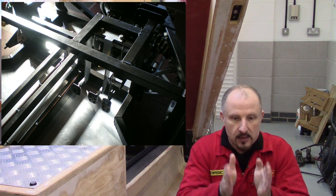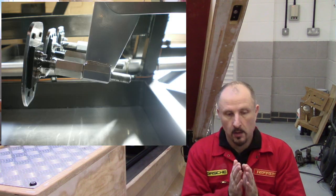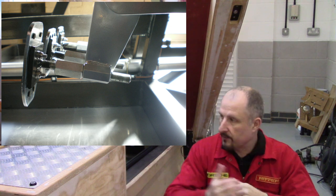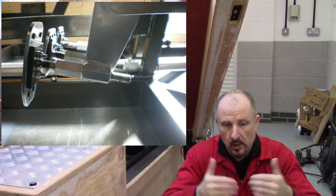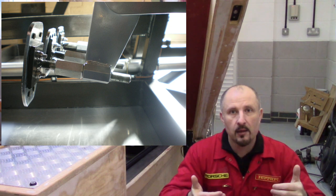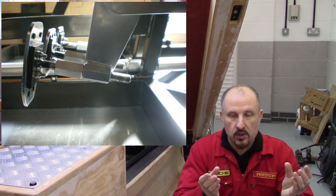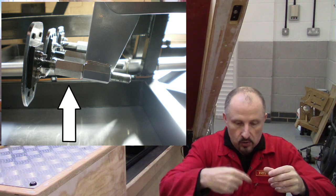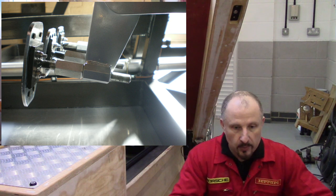As you can see, the pedal assembly is bolted to the chassis. I made the pedals thinking long term — because if this becomes a prototype for a kit that is sold, people have different feet and different legs. So I wanted to make the pedals adjustable for reach. You could undo the locking nut, spin the pedal to push it out or pull it in, then lock it in place.